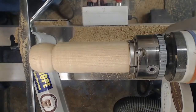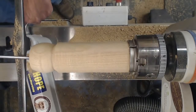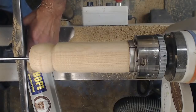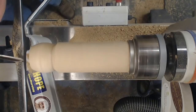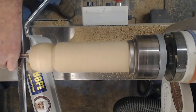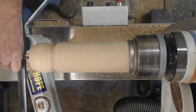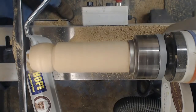And again, make sure always that when you've turned your lathe off and you're doing a different cut, that you start it off at zero or the lowest speed that you can. Now, if you do a depth hole, you need your spindle gouge at centre height when you're on the horizontal, like so. And all you do, literally, not too fast, just doing 1,000 revs now, just over, you just plunge in. Now there I'm a bit high, so I'll just take that off. Okay. And plunge. And that is one way of doing it.